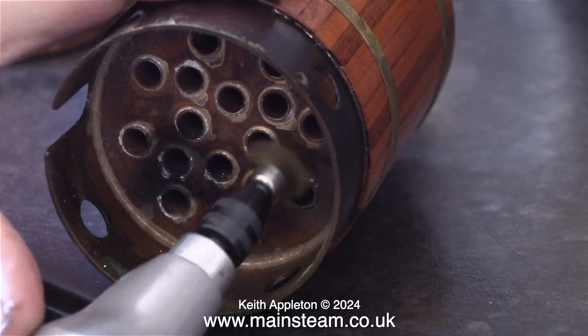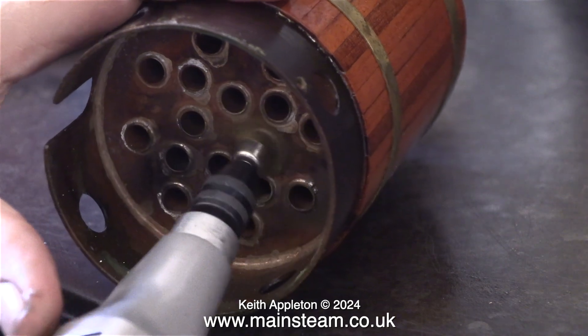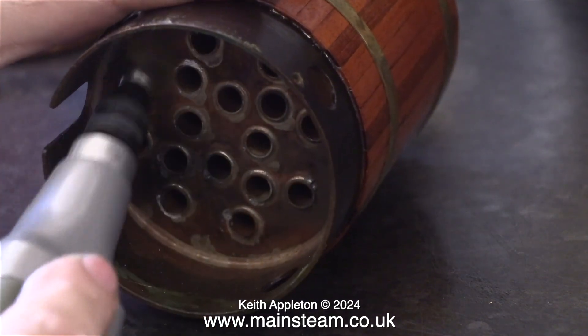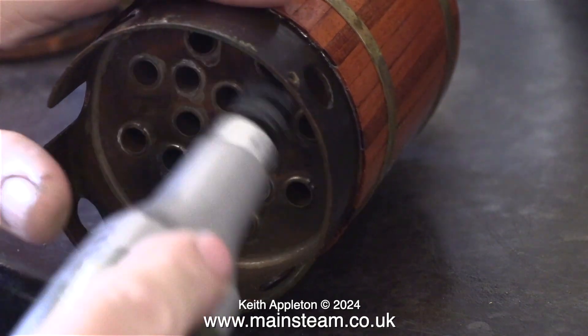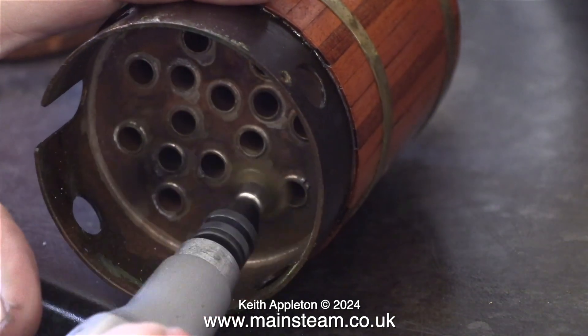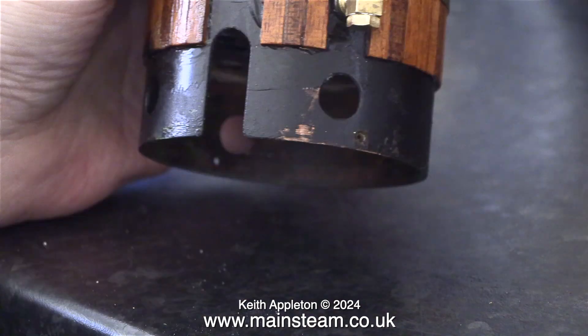On with the job. I've removed the gas burner assembly from the boiler and I'm cleaning up the bottom part of the fire tubes. There was a white residue around the bottom part of these tubes, which initially was cause for concern, but I figured out what was causing it. The first steam that contacts the cold engine condenses to water, goes up the pipe, down the chimney, and that's what causes the white residue around the tubes. The overall construction and condition is good.